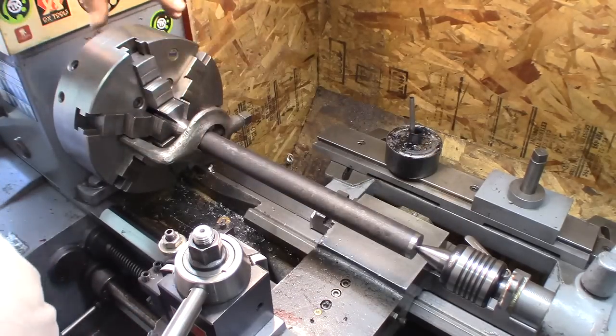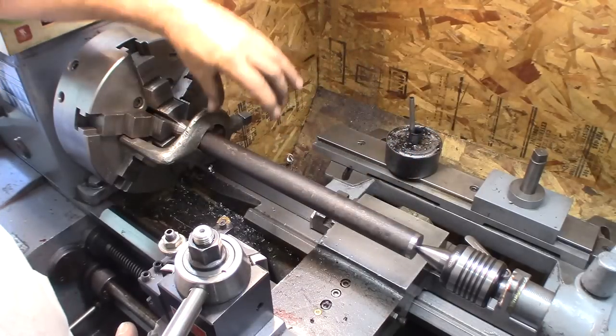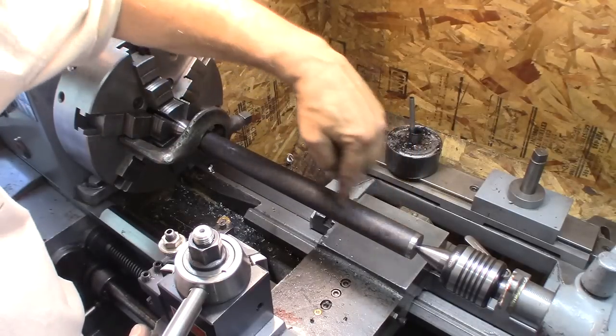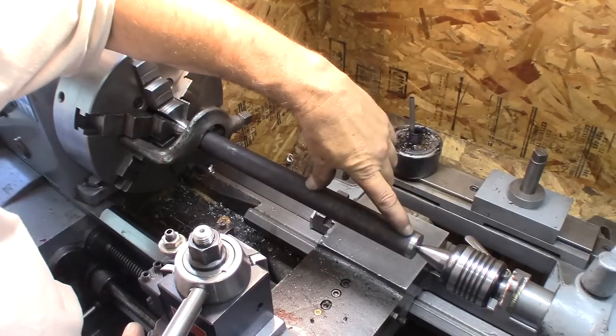We're going to try to get it down to an absolute minimum. What I'll probably do is say I'm going to use this end for the gear and this end for all the other turning, which are quite a bit smaller diameters, and then I can turn 4, 5, 6 inches worth, and gauge my taper a lot better.